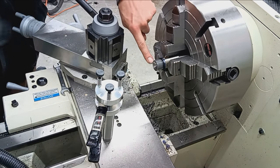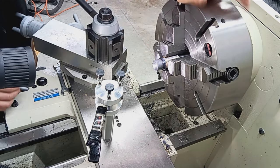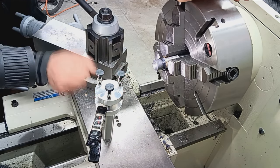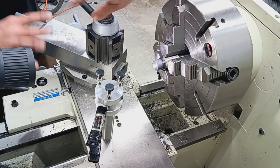We're going to pre-drill that chamber like we do. Get most of that material out of there and then finish off with a finishing reamer. So I'll get this all pre-drilled, set up, and I'll show a couple feeds of the chambering reamer, and then we'll come back.